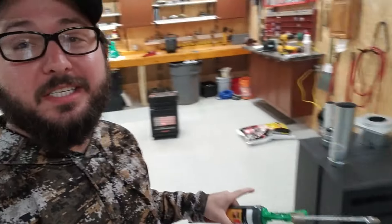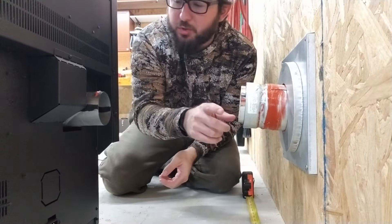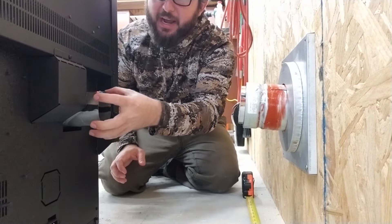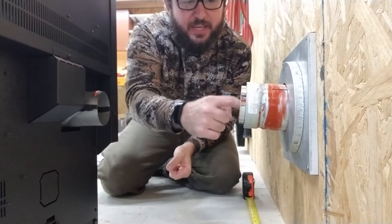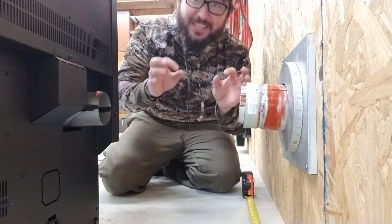Duty called there for a minute so I had to set the stove project aside — it's now a couple of days later. So like I was just saying, going to take the high-temperature silicone and sleeve together my pieces of stove pipe, both onto the back of the stove itself and going out the side of the building. Going to make sure I get a good tight seal with the silicone to prevent smoke migration working its way back into the building. This is probably going to be the most crucial joint with the silicone, so I'm going to make sure I glob it on both the connection coming out of the back of the stove and on the inside of the stove pipe where they sleeve together, to make sure I get a really tight connection.